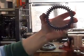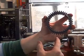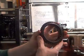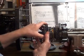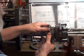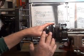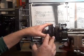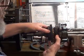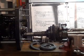This is incredible — this piece of metal being in a circle, the only way it's not going to grip is if it explodes. This is like kryptonite, this is unobtainium — this is some incredibly hard material. It's not going to go anywhere; you'll break a tooth off before this explodes. It's just incredible engineering, and that's why it was copied so much. If you learn this principle — the synchro hub slowing things down, the brass part acting as a brake to get this to mesh — then your power is transmitted completely. That's all there is to it.